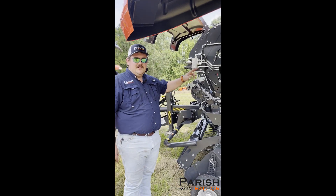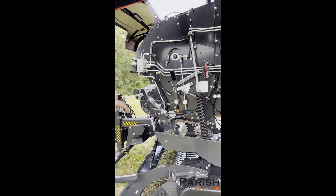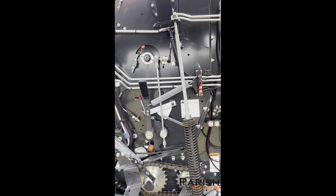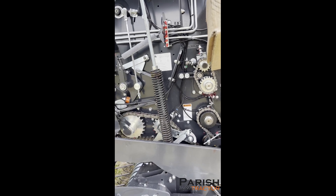What we're going to talk about next is how the baler builds the density in that bale. This baler is what they call a variable baler — it uses hydraulics. The variability of the tension comes into the hydraulics. Your return system is limited by how much hydraulic fluid actually goes back into the tractor, and it uses that as density.